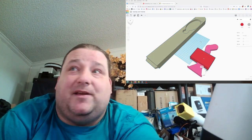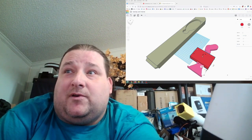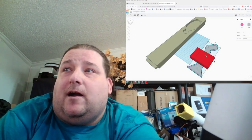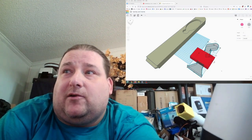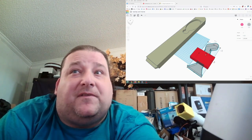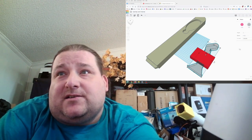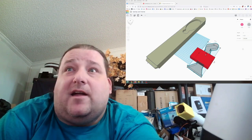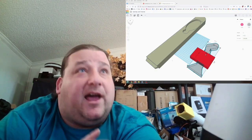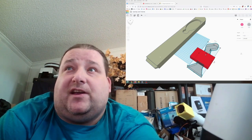I have a little square here to obscure the bitting so you don't see the full key shape. Now I'm going to turn this into a hole, make it taller, and place it on the plane here to cut it out. This bit on the end lines up with this edge, and I will cut the key out. I'll then rotate 180 degrees and cut it out again. The end result will be a cut key — this is your standard key blank.